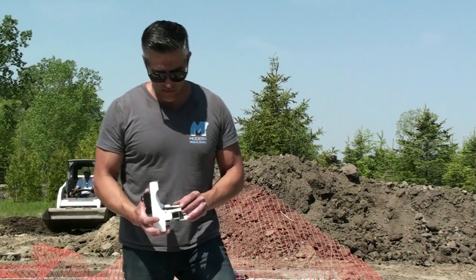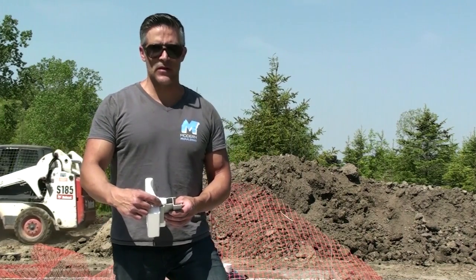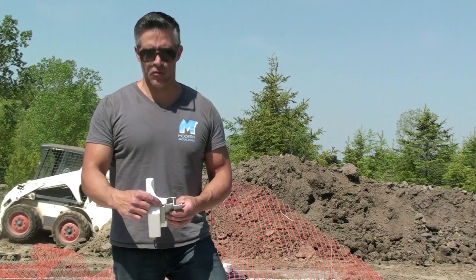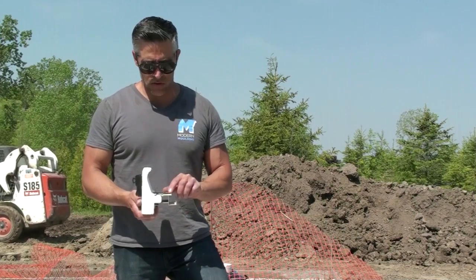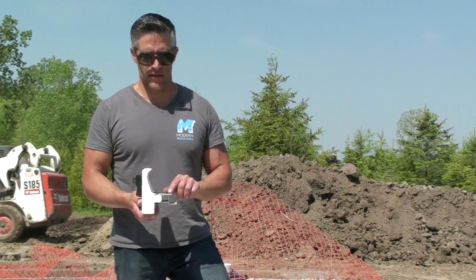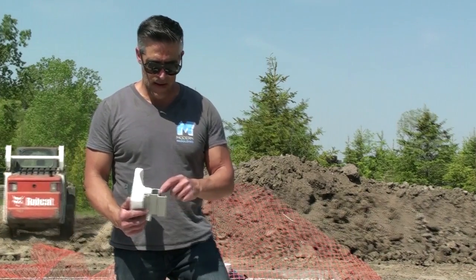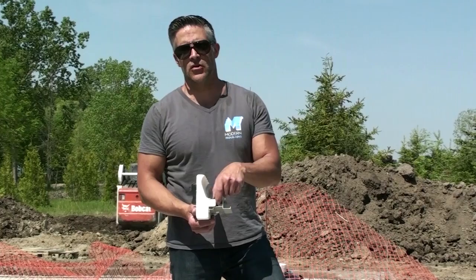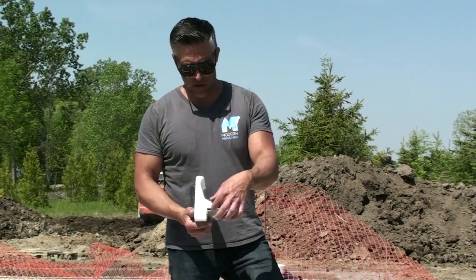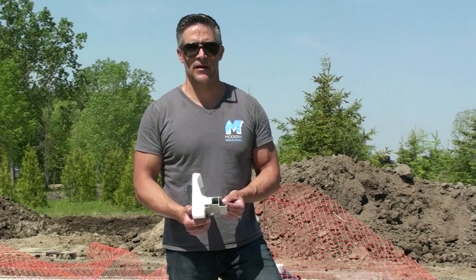The only important factor that you have to keep in mind is there are some that don't have this bead receiver, so our reusable clips won't work. But if you take these clips that you use for the fiberglass, you use a self-tapping screw right on the end there. You just have to make sure that where you put the screw in is past this wall right here. You don't want to be inside this area, because then you won't be able to put your auto cover track inside there. So you just want to make sure that screw is back on the outside.